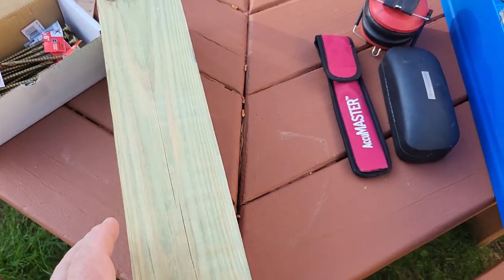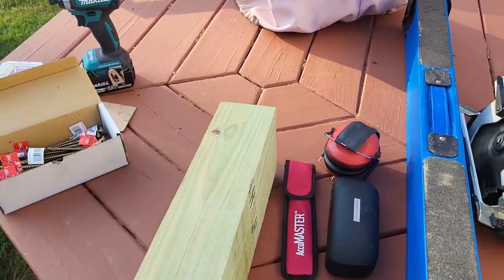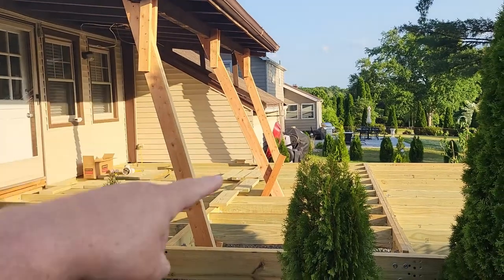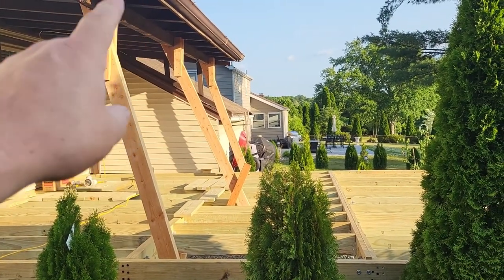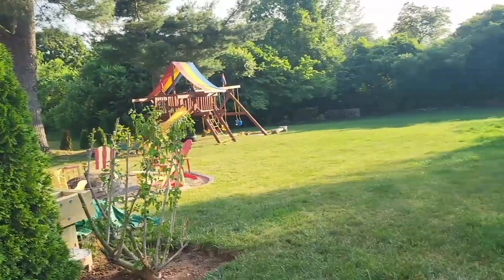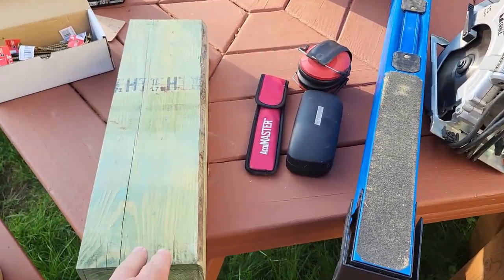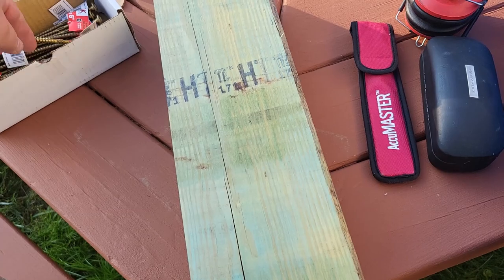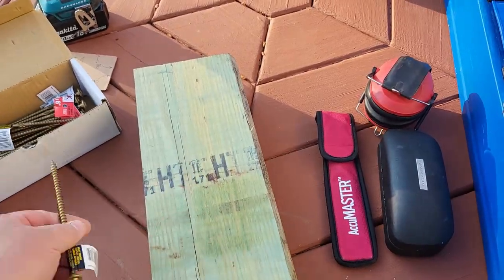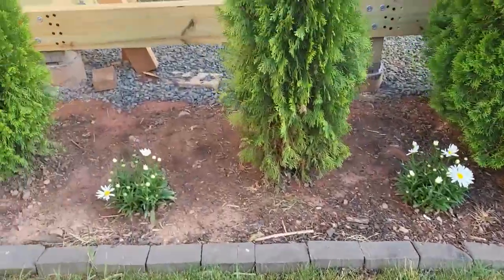And so when the 4x6 goes up, it will be up this way, not this way, because this roof in relation to the flooring is actually pretty low, where in its current state my head misses the current beam by about 1 inch. So we're going to turn the board sideways and secure it that way. So here you're looking at 3.5 inches in thickness, plus the screw coming through. You're gonna get another 3 inches into the roof joist itself. So that's why we're doing that. And I'll probably, I don't know, maybe I'll countersink them, I haven't decided yet.